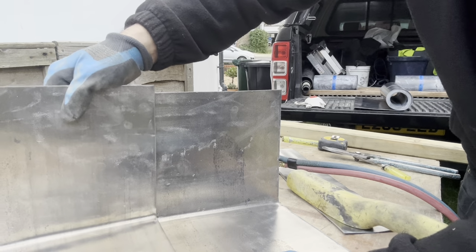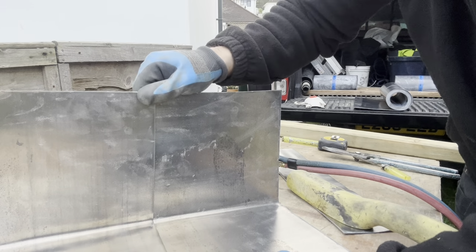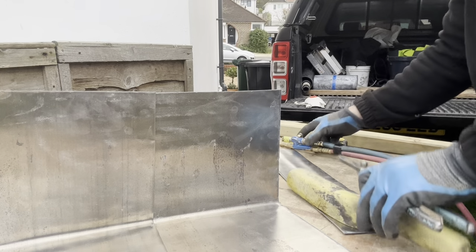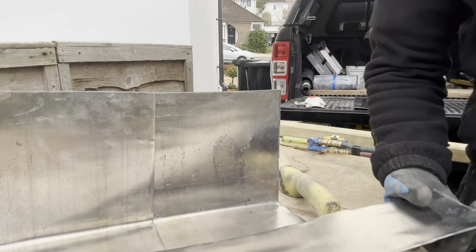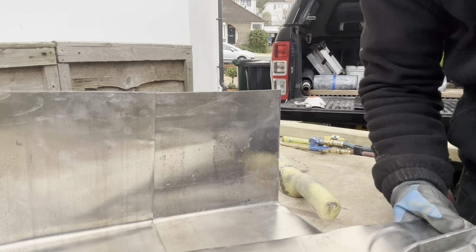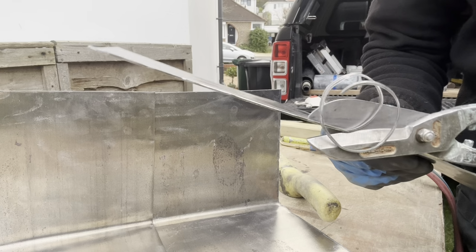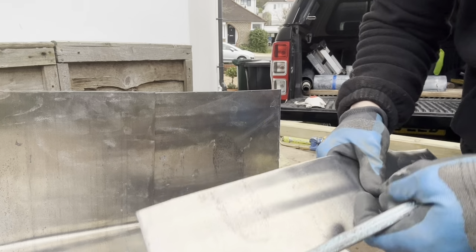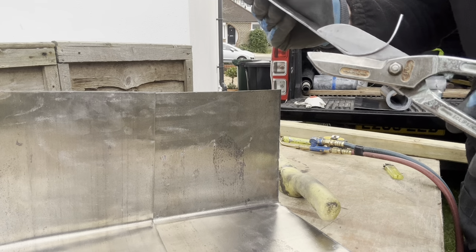So what I'm going to do is I'm going to lap that. I'm just going to lap it by about 25mm. The next thing I'm going to do is I'm just going to cut some sticks off, just off the roll. I like mine relatively thin, especially for vertical. Just find it a bit easier. Only deal with small bits dropping off the stick at one time then. And also the thicker it is, the more lead it's going to release in one go.